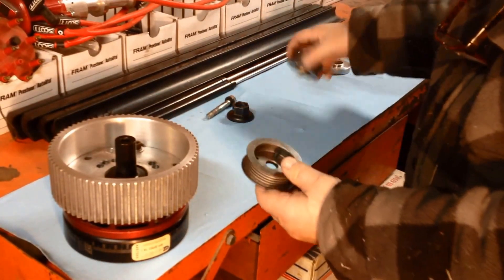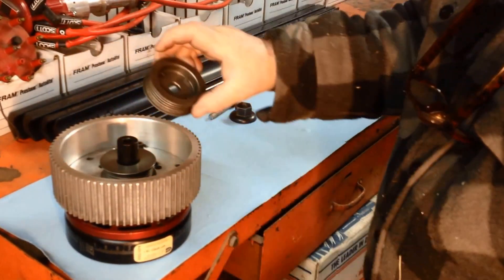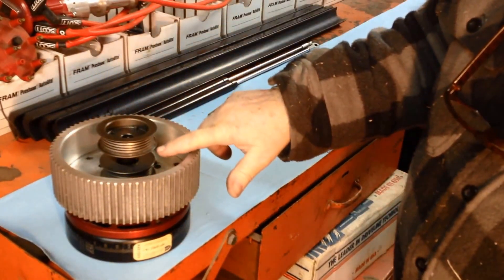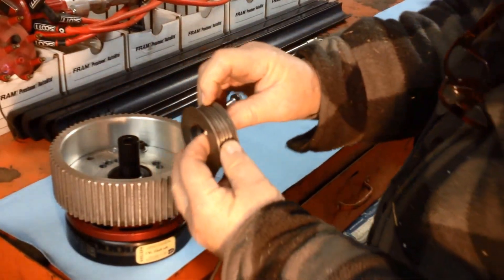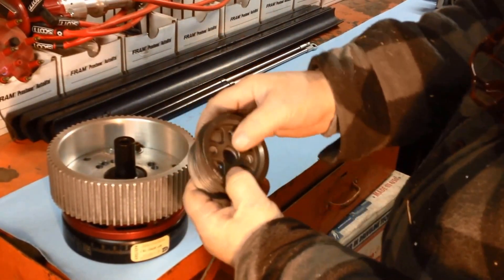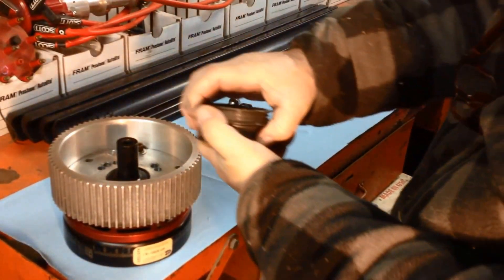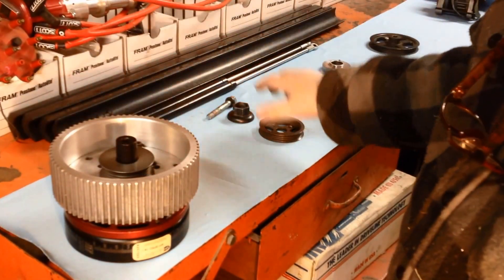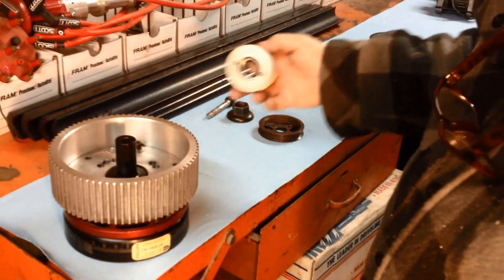If you look at these pin drives, this one goes all the way down and engages. But then if you look at this one, it's got the pins on it but it's got a small diameter so it fits on the end. So I can drive this right off the end — center this, drill and tap into this, not use this as a pulley, but use this smaller groove which matches the alternator, and set all of this on here and drive that pulley that way. I'll probably machine that up today — I would turn this off of here and then counter-drill the four holes on it, and then this whole thing can just drop right down there into use.